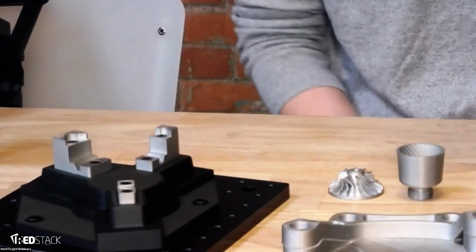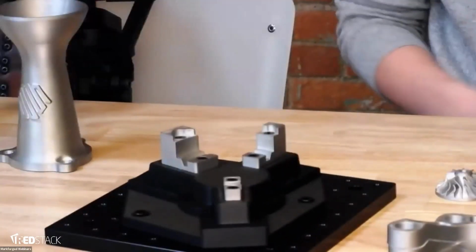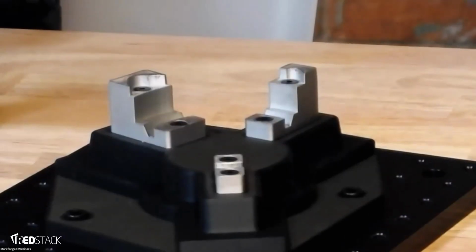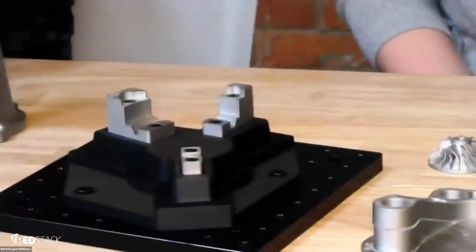So not massive times. What you're really seeing in turnaround and fabrication times is the print time plus about 1 day for sintering regardless, plus somewhere between a day and 3 days for washing, depending on how big the part is. Someone asked how long the sintering cycle is. It's about 25 hours. We're probably working on getting that a bit shorter, but right now that's the cycle that allows us to yield the most successful parts.